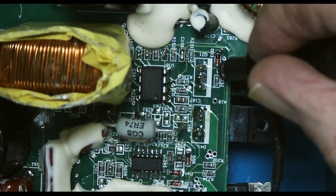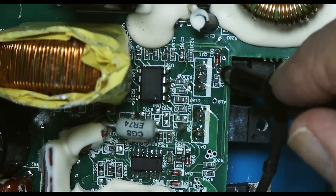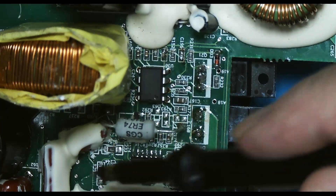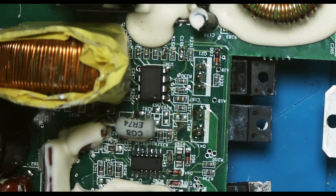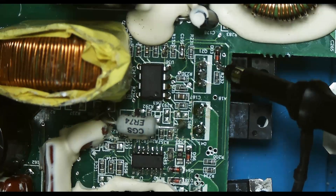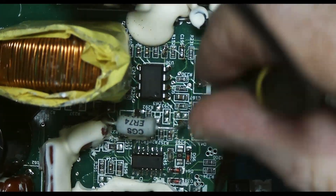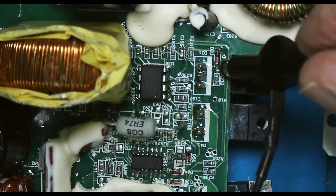So why is that? All I've got to do now is put a voltage on A7 — which I think is pin 9 of this IC — to see if the other PWM is working and brings this PWM frequency down to 68 kilohertz. Then we could possibly try to connect it up to the mains and see what happens.